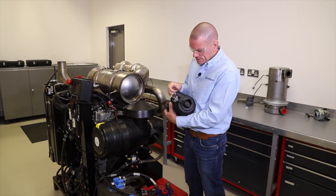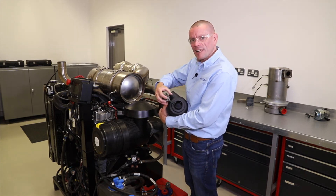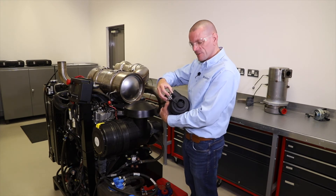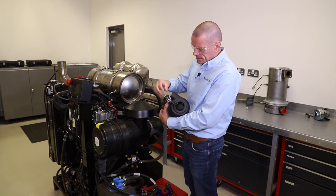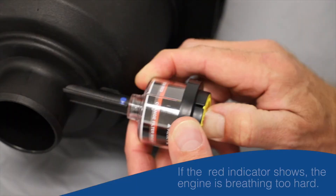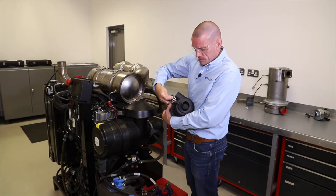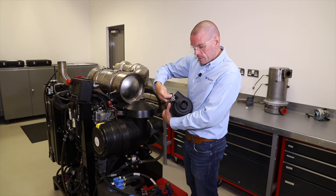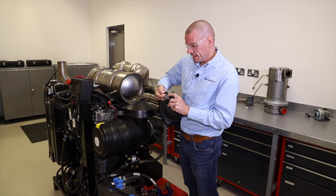When that happens, it draws a little red plastic cap in towards the air cleaner because the vacuum is building up and it's having to suck harder, which tries to draw air in through this little diaphragm. If I push this yellow test button down, you can see a red cap appearing in the window. That red cap appearing in the window indicates it's sucking harder than it should be and the air filter is becoming blocked. This latches in position so the red is permanently visible if the air cleaner is too blocked.